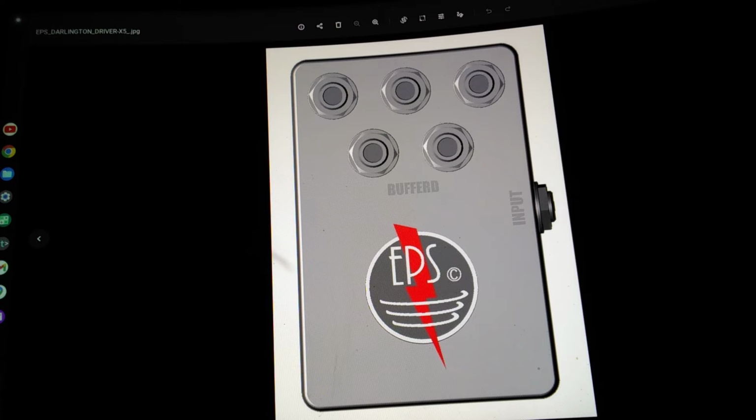Basically kind of the same thing, and the reason why is because the EPS amps are using Alnicos, and they would be lower to the stage, and they would couple with the stage better. So it's a sensitivity thing. Even though it would only be 125 watts instead of 200 watts, it's going to couple better with the stage, and it'll act like a horn kind of, and it would be about that much acoustic power, pretty close to it.